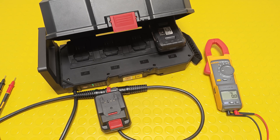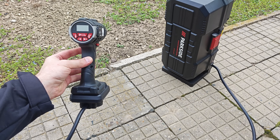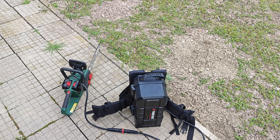I'll disassemble the machine later to better explain the behavior. If you insert four 12 Ah batteries and use the backpack to power a 20-volt tool, you can virtually run it for days — that's 48 amp-hours total. For 40-volt tools it's even more beneficial since you won't need to carry two heavy batteries by hand — your hands won't tire as fast. In that configuration the maximum capacity is 24 amp-hours. The cables are long enough to put on and remove the backpack without straining them.